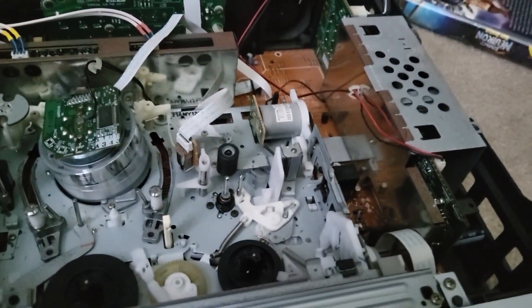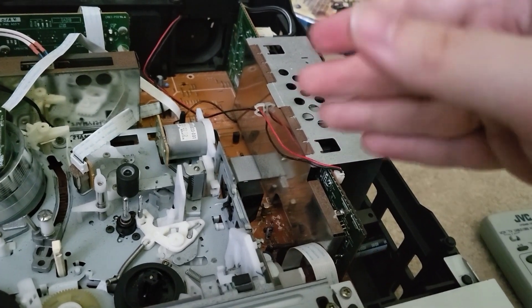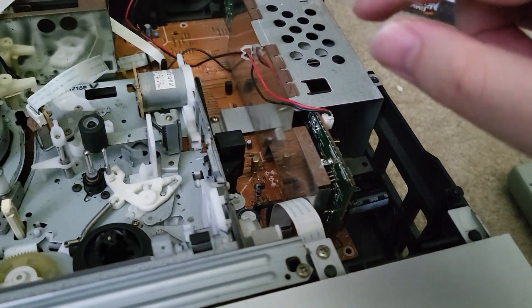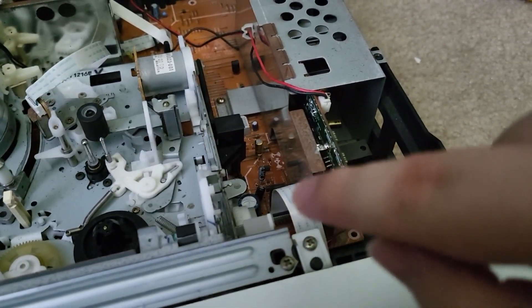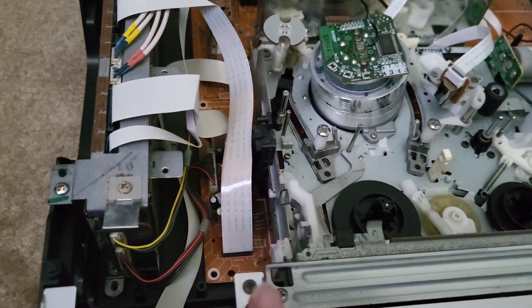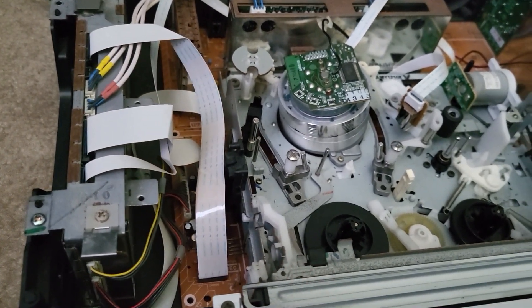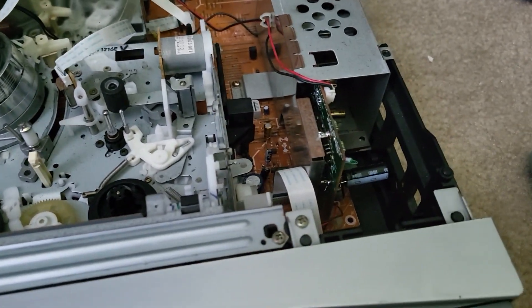Something annoying on this unit in particular: on the 30000U, the power supply is just one big block — it just pops out after undoing the cables. But on this one, it's split onto this part here and the main board. See those little caps right down there? That's the DC out portion of the power supply. Those are the caps that are really going to give you a bad time if they go bad, because they're not going to filter the noise on the DC line. If you have noise on the DC line on something like this, you're going to get wacky results. That means you've got to remove everything in order to get at the main board to replace the caps — it is stupidly frustrating on this.